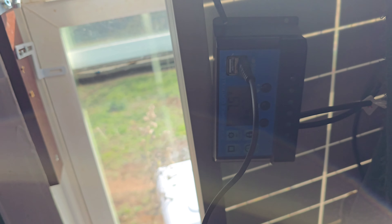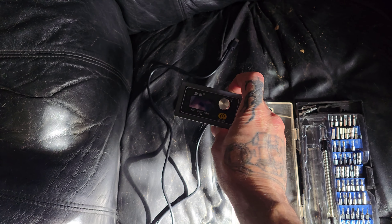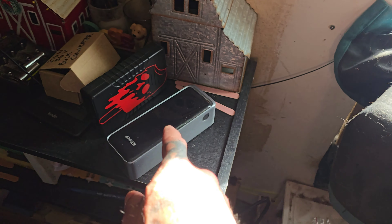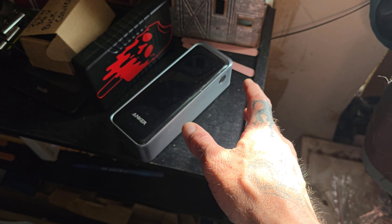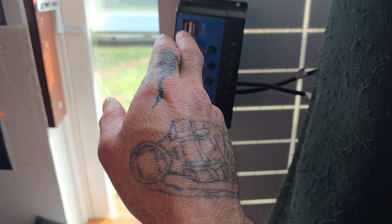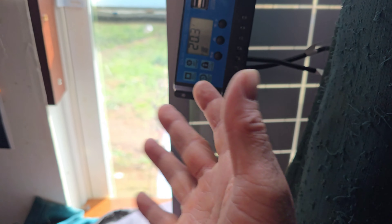So maybe I'll swap that out for the buck converter and see how that works out. I hooked the buck converter up to the solar charge controller on the battery output and wired up a USB-C cable to it, ran it to this battery, and I was getting like 0.8 watts — something ridiculous like that. It was going to take a hundred hours to charge this. Absolutely useless. I assumed it's just crappy old USB connections on here. They don't put out anything for power and they're not going to charge your typical cell phone nowadays.